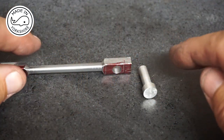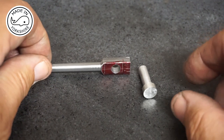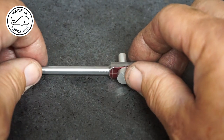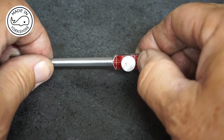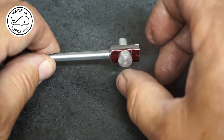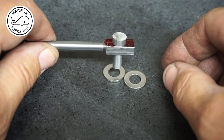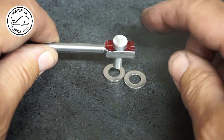In order to turn the 3/16ths of an inch radius on this end, I've turned a piece of aluminium with a quarter-inch shaft that fits nicely into the hole and a 3/8ths of an inch radius top, which defines the radius I need to work to. I've decided to loctite that in place, put some packing underneath it, then put it in the 3-jaw chuck attached to the rotary table and try to just turn the edge.